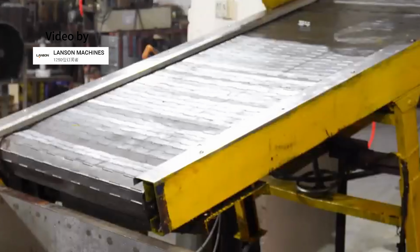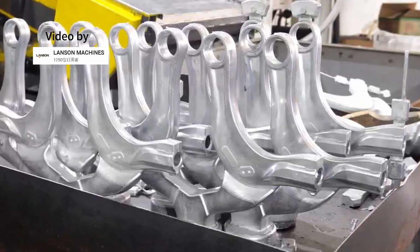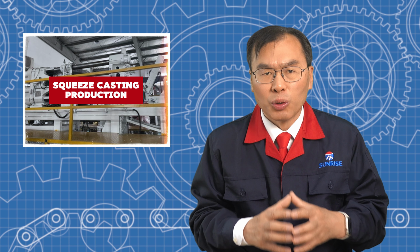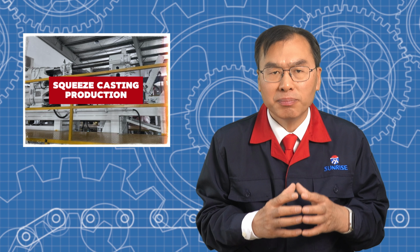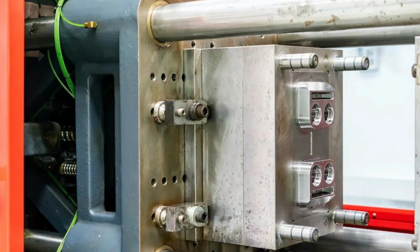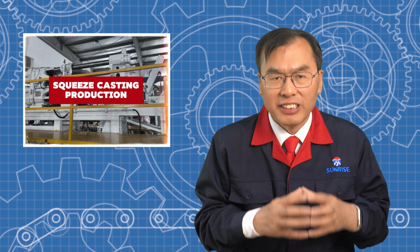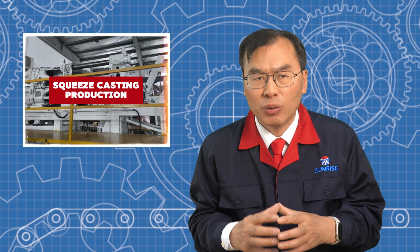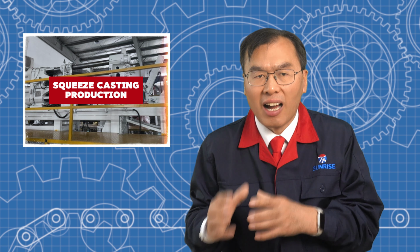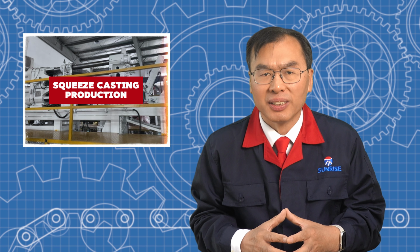Squeeze casting can be cost-effective even for low or medium volume runs, especially when you need high part quality and minimal defects. Because the process doesn't require a complex gating system or vacuum setup, the tooling is often simpler and faster to build. That helps reduce the upfront investment. And since the parts come out with good surface finish and tight tolerance, you can often reduce or even skip secondary machining, which saves time and cost down the line. It's a smart choice when quality matters more than high volume output.